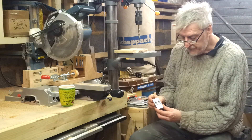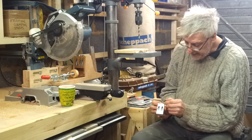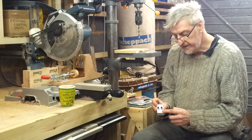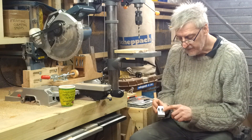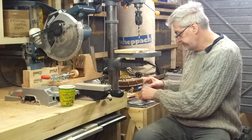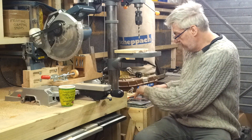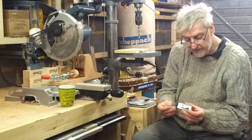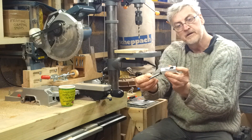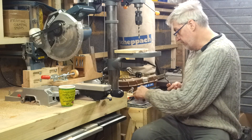Steel bushes drilled through to produce a pocket hole in the wood. The problem with this is that the bushes inserted at the top hole are set at the diameter of the drill, but this does not continue through on the jig itself — that is at a larger diameter clearance hole. So when you drill through it gives a lot of breakout on the pocket hole — not a good result. The additional problem was the clearance in the hole for the drill gave a significant amount of slop, which equated to a point movement of the drill of 3mm, which to me wasn't satisfactory.